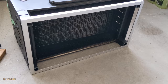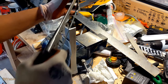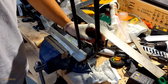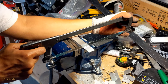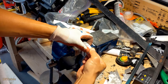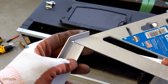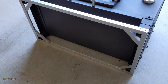Aluminum is very thin, so we need to do some bracing at 45 degrees angle at the corners. We cut about one and a half inches in the middle of the angle bars and get rid of one side. With the other side hanging, use the hacksaw to mark a line there but don't cut it. Use your thumb to press on it and make a 45 degree angle. Now all the corners are completed — the base is rock solid.